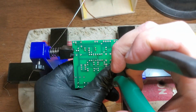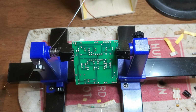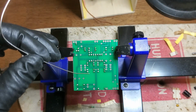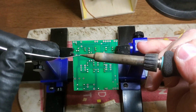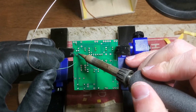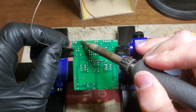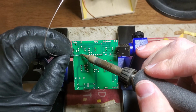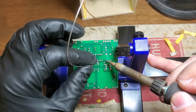Because this is a slightly modified synthesizer circuit, the entire thing is intended to be worked with a bipolar power supply, right? But since we're in Guitar World and I'm not doing any charge pump tricks to derive the bipolar power supply, I basically have to float the entire thing around a half supply voltage reference, which allows me to get away with having very little coupling.